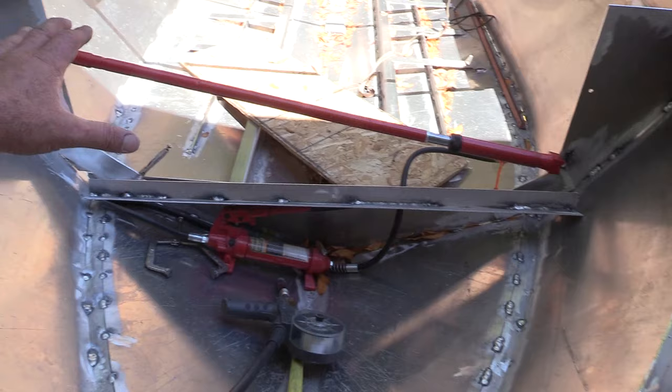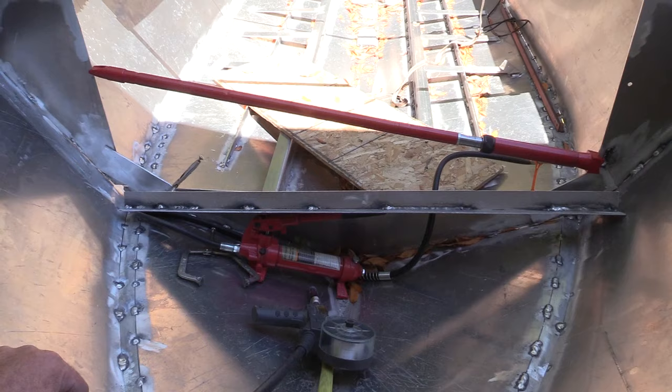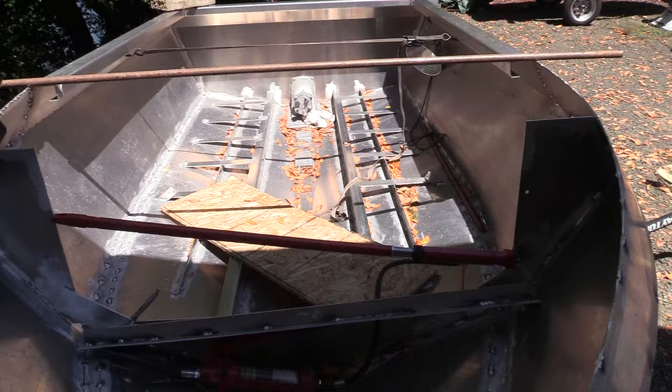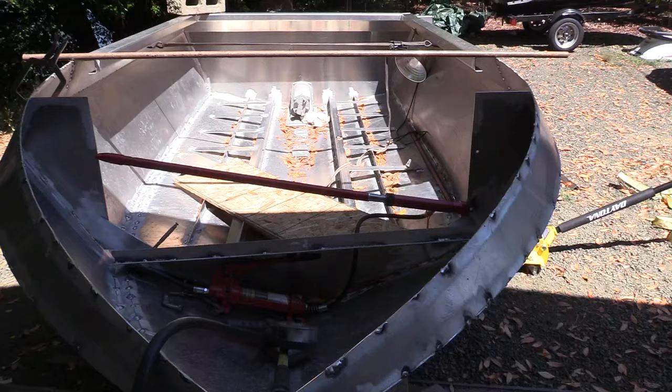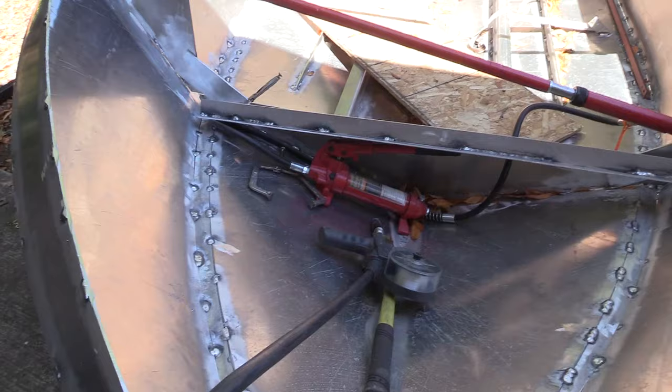The hood is after the fact, it's added rigidity, but it's not what's actually holding. Now my top brace and these side braces are taking the place of what the hood normally would be doing, as a more primary function in rigidity in the front of the hole. So I'll probably just go ahead and weld the inside of all this while the hood's off, and then fit the hood. This bracing's there, it's not going to move. I'll weld up the bracing first, and it's not going anywhere. So that's the plan.